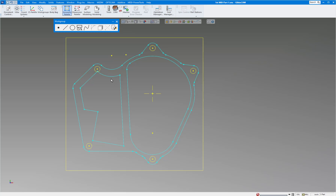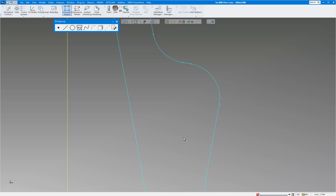The only thing left is to put quarter-inch fillets everywhere. Double-click the pocket shape — 0.250 is already in the fillet field — and the left-side pocket is done with fillets.